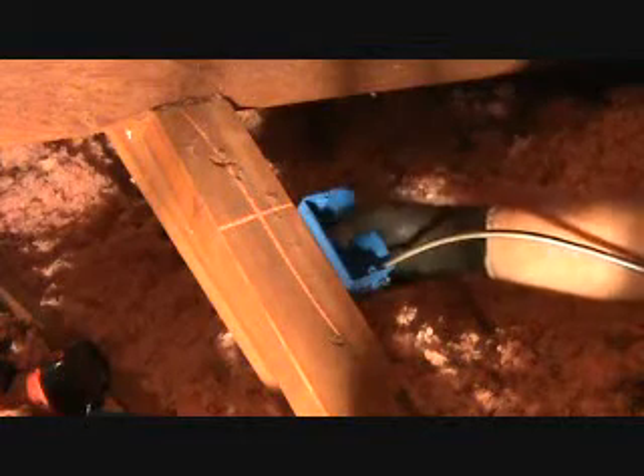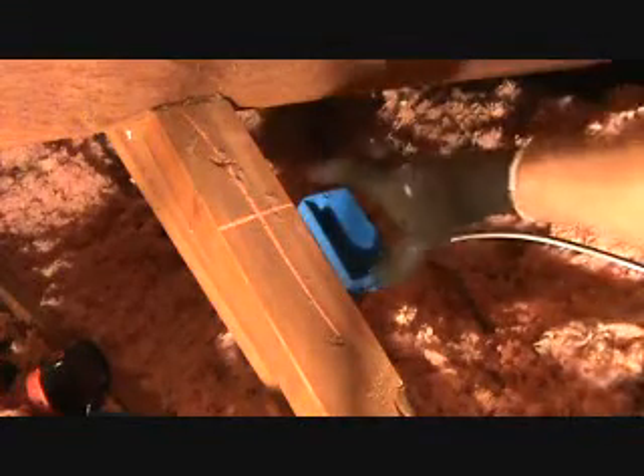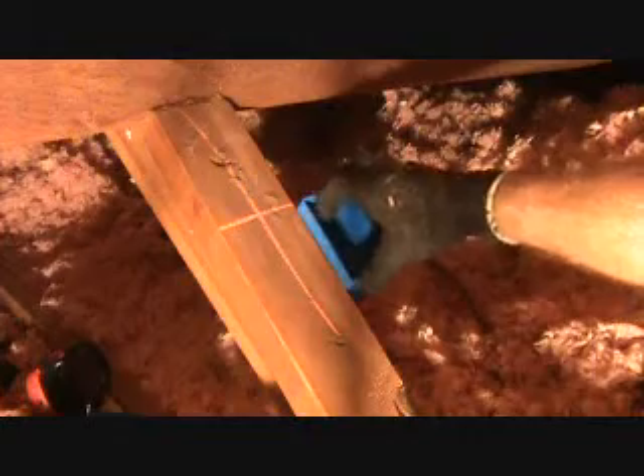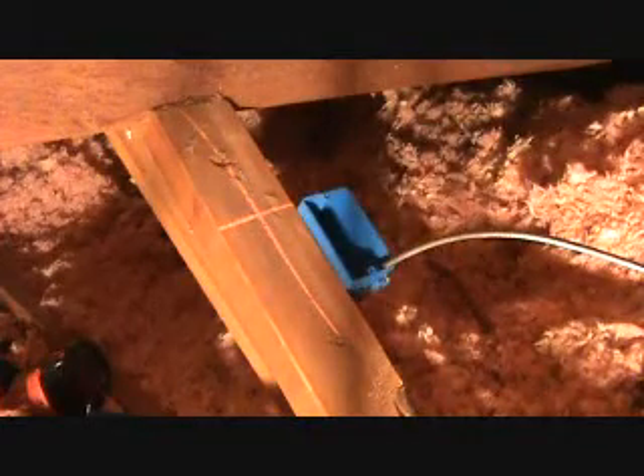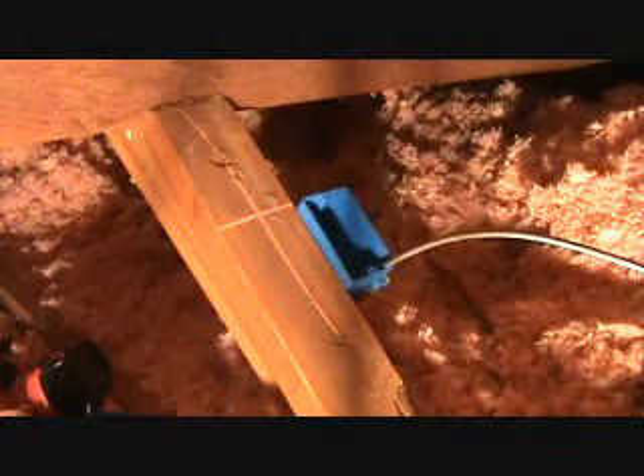I got a fairly deep single-gang junction box because I'll have a few wires in here. I could have got a two-gang box with a blank plate for extra wire room. Another thing you could do with a junction box up in the ceiling is add a plug — maybe you want to plug something in up in the attic. You put a cover plate on that, and next time you're up here near the crawl space you can plug in an extension cord or a trouble light. But this is pretty close to the far end of the crawl space, so I'm just gonna put a blank plate over that. Step by step, follow me.